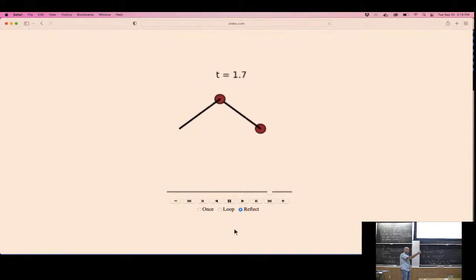So what happens? We already got an answer, right? So at that instant of being completely out straight, it is true that the Jacobian is singular. If I wanted to instantaneously command a velocity back here, I would fail. But I can accelerate back in that direction, right? The derivative is okay. I can accelerate in that direction and get myself out of the singularity and eventually get back and everything's good again.